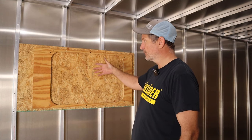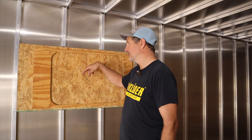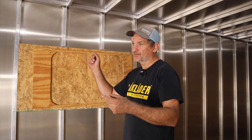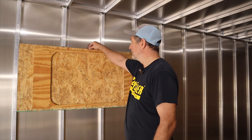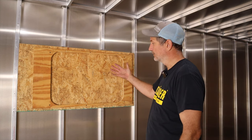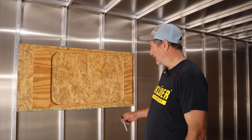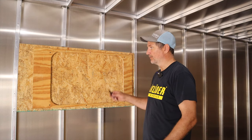Now this template gets screwed to the first one. I'm going to pull that off, route the hole, then screw the first sheet to the back sheet and glue it. And when that's set up, I'm going to route that out so the two holes in the two sheets of plywood are identical, glued together, put in, and it's going to be wonderful.